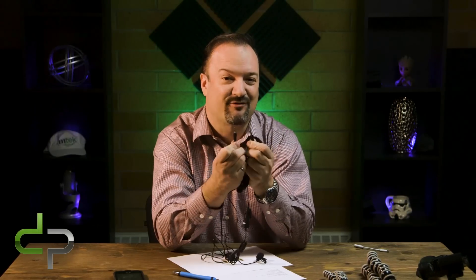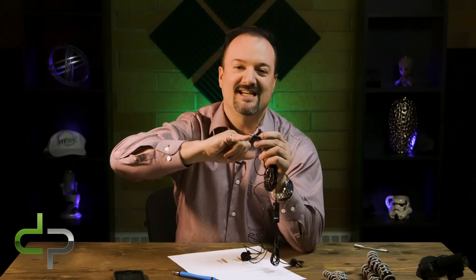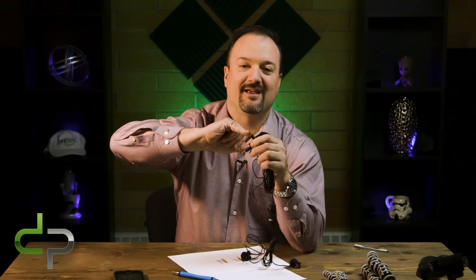Here's the gotcha. I'm going to show you two different wired lav mics here, but they both actually appear to have a similar connector. It's called a 3.5 millimeter connector, but they're actually different. This one only has two black lines on it, and this one has three. We call this a TRS connector, and this one's called a TRRS connector.